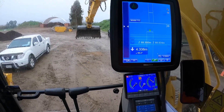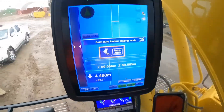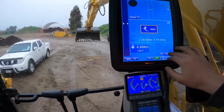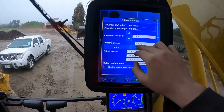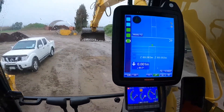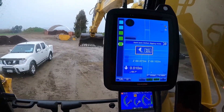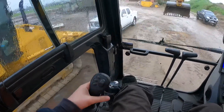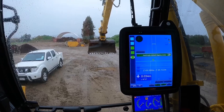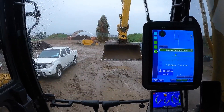You've also got to turn on your semi-automatic — you have a trigger on the back of the joystick and on the monitor as well. When it's in manual mode, I'll zero it off — or match it off the bucket — and it has a reading, it knows where the bucket is. Now I'm on grade for a flat surface. In semi-automatic mode I can just pull back with the dipper arm and it'll automatically keep it at that height — accurate and nice and smooth, just like that.